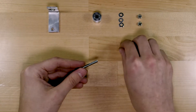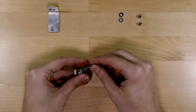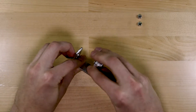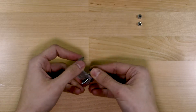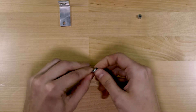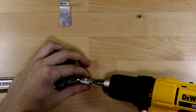We'll start with the screw, put the first washer on to form the top, and then stick on our timing pulley. That'll be followed by the rest of our three washers — you may need to vary the number of washers depending on your design to get the spacing right. As for why there are two nuts: if we just tightened it down to the L-bracket, the pulley wouldn't be able to spin freely. So we'll mount the first nut as an anchor point for the second. It's important that the pulley be able to spin freely.